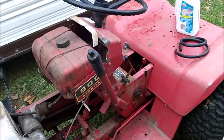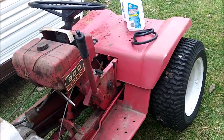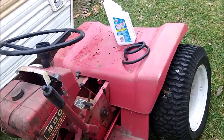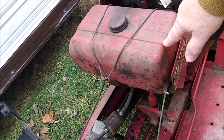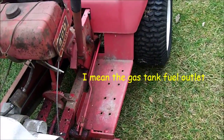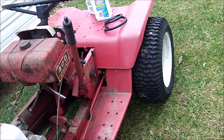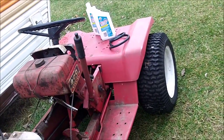I'm gonna install this — it's not much of a video, so I'll just install it and check it out later. One thing I want to tell you guys though: when I bought this tractor I had a little tiny leak around the inlet here, and I used JB Weld repairing that tank and it has held up really well. As long as you prepare something like that — sand it and get all the dirt off — it seems like it works pretty good.